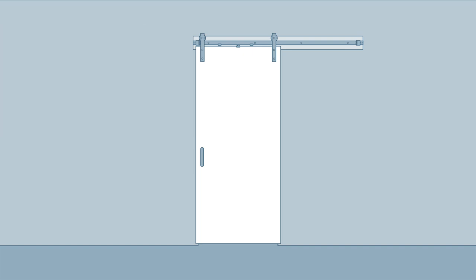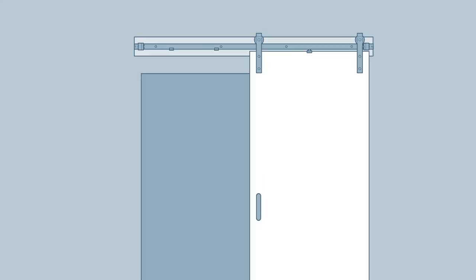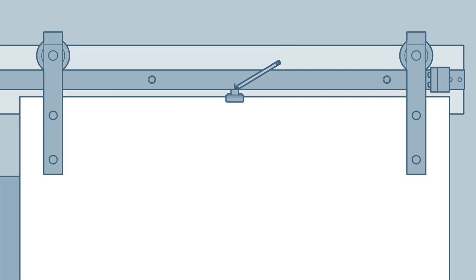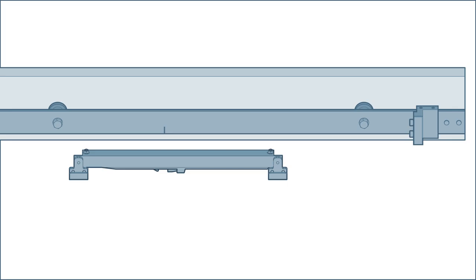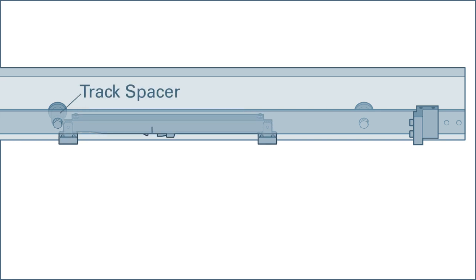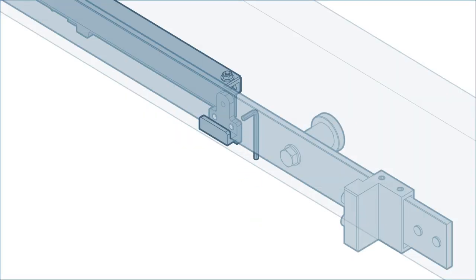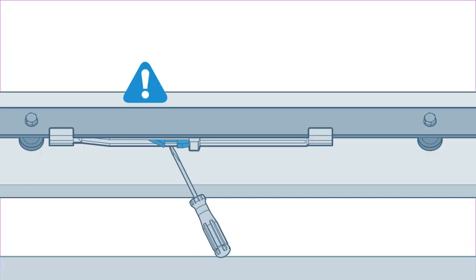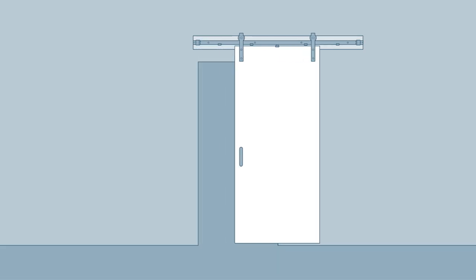Slide the door to the open position. It will require more force to pull the door because of the spring in the soft close assembly. Use a pencil to mark the center of the actuator on the bottom of the track. Slide the door back to the closed position. Next, install the second soft close assembly on the track with the catch gap centered on the pencil mark. Again, if you can't center the catch gap on the pencil mark because of a track spacer, shift the position of the soft close assembly so you can install it directly next to the spacer. Then tighten the set screws on the mounting brackets. Use a flathead screwdriver to open the catch of the soft close assembly. Slide the door to the open position — it should now open softly and smoothly.